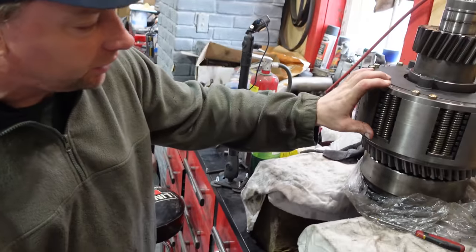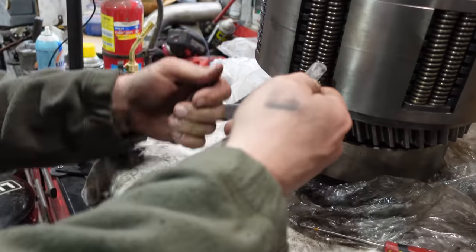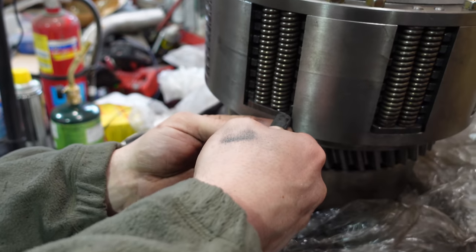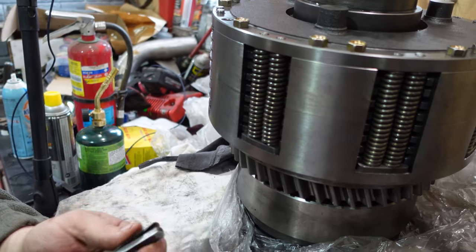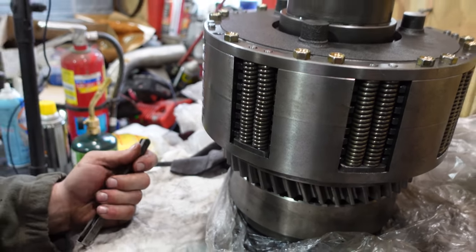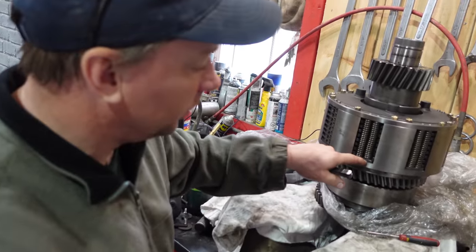Okay. All right, so we put the air to it. We got this to lock up. Put some feeler gauges in there, and trying to do everything with two hands. I could use a third one. Rich, hint, hint. And I got 6.27 mils. Gap in between the bottom plate and here? Yeah, so that's your travel, right? Yeah. You can just measure in there.